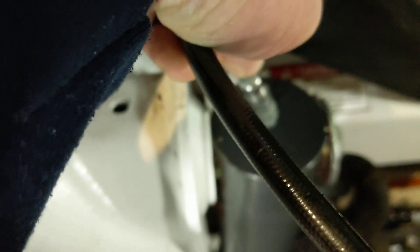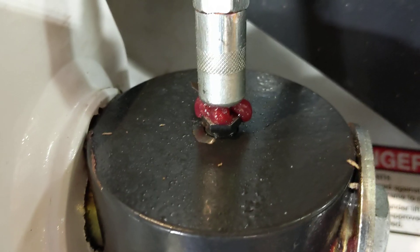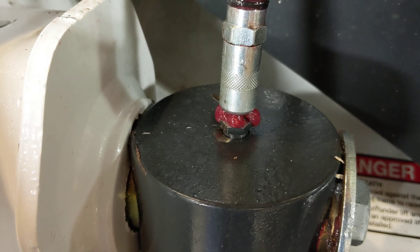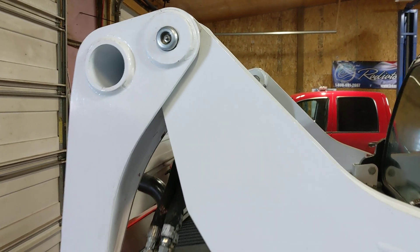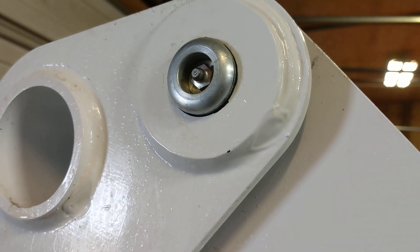When greasing the machine, it is important to get the grease fitting on securely and tightly. You want the grease to go in the fitting, not outside of it. As you can see here, the grease is oozing out around the zerk, not going in it — that tells us there is a problem and we need to free it up. Before greasing a zerk, I recommend taking a rag and cleaning off the dirt so you don't force dirt inside the bushing and the fitting.